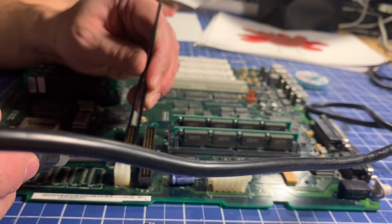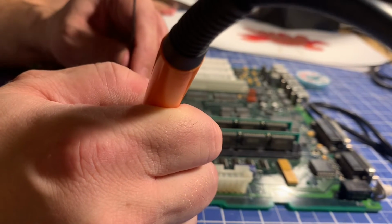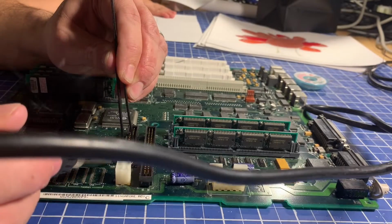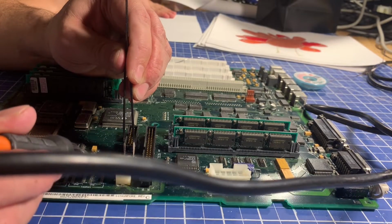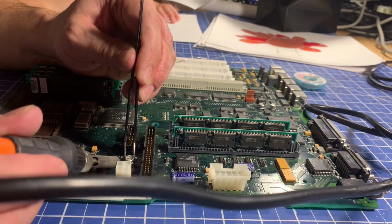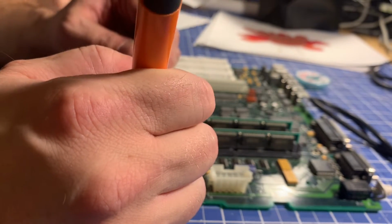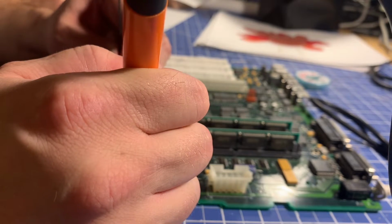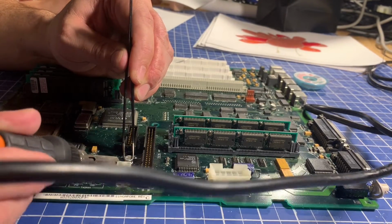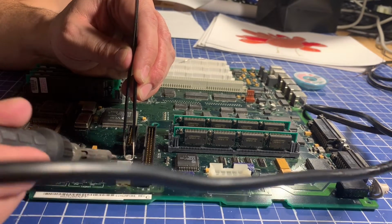And again, this one has that ever-present dead fish smell. So I'm just going to desolder one side at a time, wiggle it back and forth as they're loose to hopefully free it up and get far enough off the solder that it's not making a connection. But again, being patient and not getting too much movement at once, because that will rip the pad off the other side. I think we got this one just about. I'd say when desoldering, patience is certainly key.